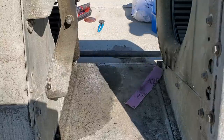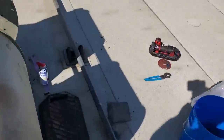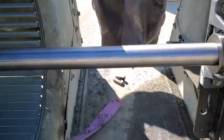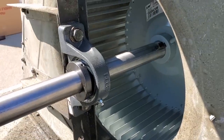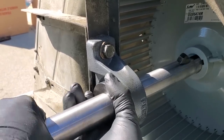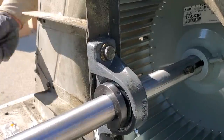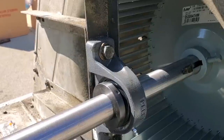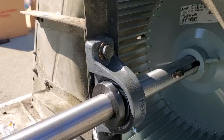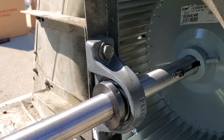There's a problem here — we've got to push the whole shaft this way a lot because there's not enough room for the key. So take the whole shaft, we'll have to recenter everything, and push it this way. Find out how much it was sticking out on that side. We need to get it basically about right there. Go ahead and clean up these other keys.